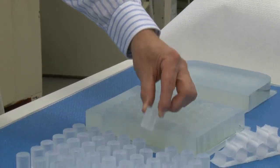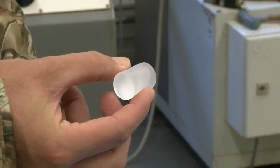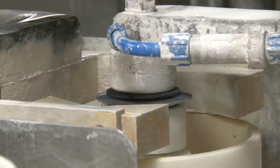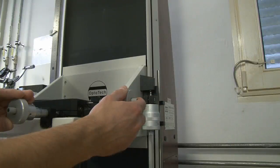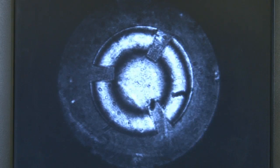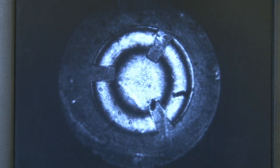Upstairs, the slice is soon diced and we start seeing things take shape. Now we're going from the world of flat glass to the more glamorous world of round glass. The interferometer is not, as it sounds, the work of a Bond villain or Ming the Merciless, but measures how good lenses are. Parallel lines show that the lens is perfect from one direction, and concentric circles show it is perfect from another.